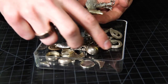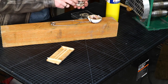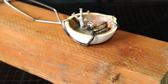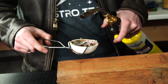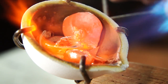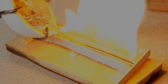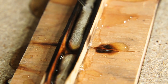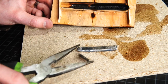I'll just pick out a few scraps that should work nicely for us. This little crucible — you can get one of these for really cheap just on Amazon. Just go ahead and put your metals in there. I'll use the map gas, heat this up, get it molten, and then we'll pour it into our mold. For melting, just make sure you're using a map gas torch — this will get to a much higher temperature than a butane or propane torch. It's enough to melt the silver. Just don't hold it upside down. Ready to pour. Got ourselves a nice, perfect little stick of silver. I'll just throw that extra piece back in my scraps to melt down again later.